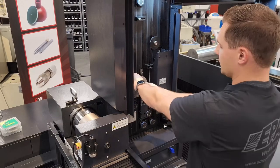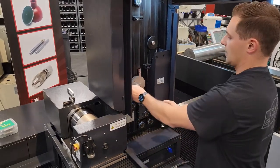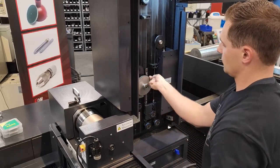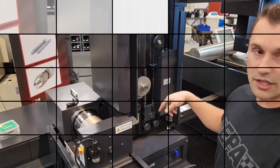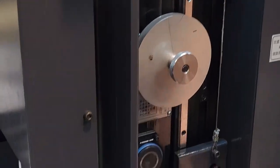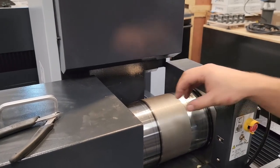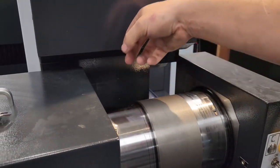You're going to want to make sure to get this snug. Once that's on, we can take the end of our wire, go around the roller, and start doing some circles around this. Now we're set and ready to start pulling the wire. One other thing you're going to want to check — make sure your wire is tied off, and make sure you have the wire ran around one of these rollers. So when I turn this roller to pull the wire off, we're also rolling a roller on the bottom. Right before we pull the wire off, we're going to unhook the other side, and then we can go turn it on.